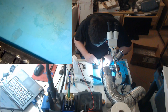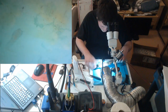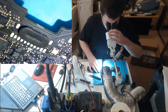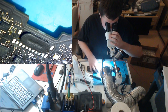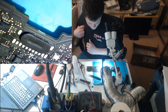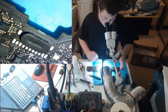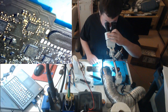The ISL is going to be the only chip that's going to say no, shut off, and maybe that somehow got screwed up with water, it didn't corrode, I don't know. But this chip is easy to replace. Is it our issue? I am not sure, but it seems like the only educated guess we can make right now, that the ISL is telling the charger, no, shut off, I don't want to deal with you. So it shuts off. Could it be U6901 and U6900 on my DCM board? Maybe, but I'd rather try a new ISL first, so let's go ahead and change this ISL out.